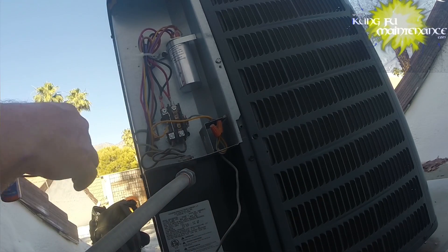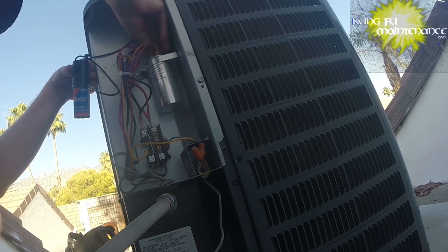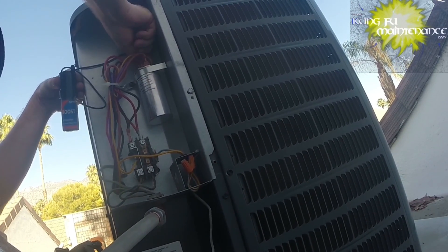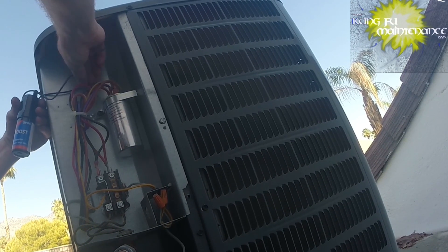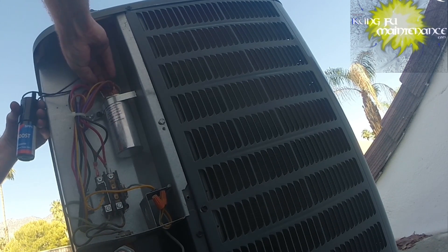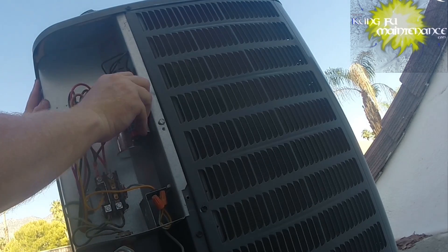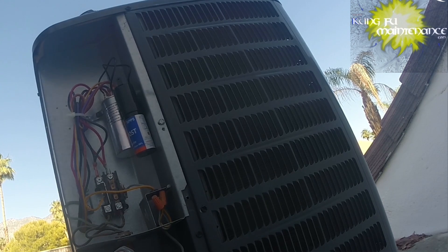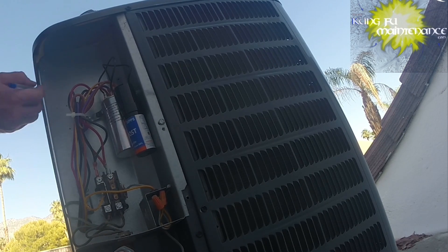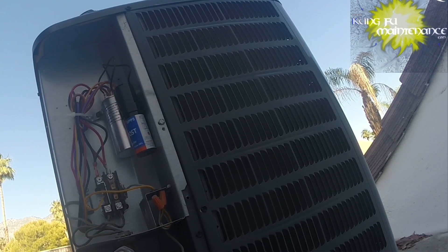I was up here just the other day, reached out and felt the suction line and everything was nice and cold, so I kind of figured it was probably the capacitor — very common deal. This side goes on the common, that side went on the herm, and this side will go on the common. I usually put the one with the extra little peg on the common and hang the hard start kit right there — that's just perfect. I like to write the 40/5 on it with a Sharpie, but I rotated the capacitor and that'll make it easier for the next guy.